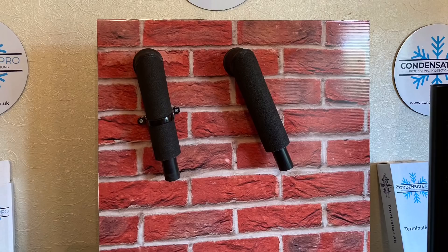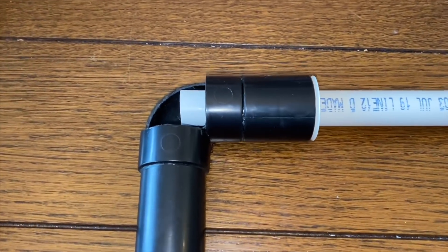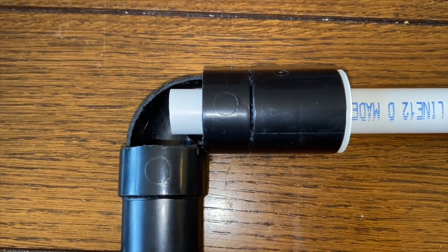Looking at the demo board, we can see what the Condensate Pro looks like on the outside. You can also take the 32 millimetre pipe all the way into the property and lag that as well in the cavity. There are some manufacturers looking at the possibility of reducing that down to overflow size in the wall, which could mean better fall. Intergas seem to be saying they are going to put this into their installation instructions — you'd have to confirm that with Intergas and check the relevant installation instructions. I'm now going to show you some videos from Condensate Pro.